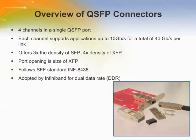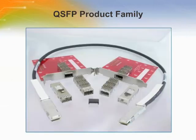The system is ideal for switches, routers, and host bus adapters where bandwidth is essential. The QSFP connector is a 38-position, 0.8 mm pitch surface mount connector available in pocket tape for pick and place applications. The QSFP family includes cages, connectors, copper, and optical cable assemblies for a complete solution developed within the QSFP MSA, the multi-source agreement.